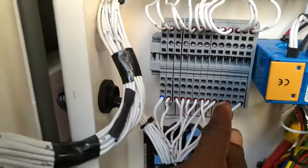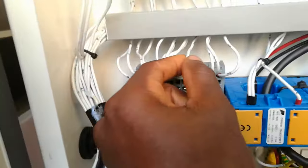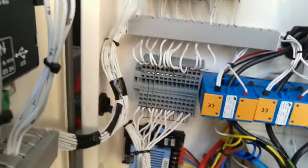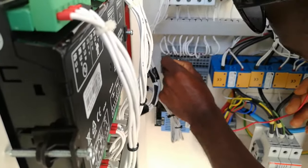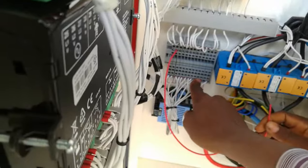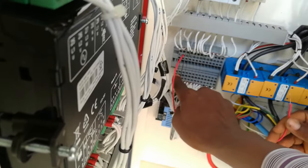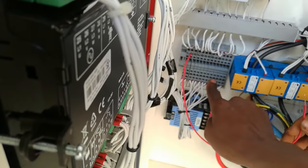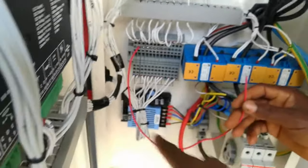This terminal is actually vacant, waiting for the ATS connection. That terminal is attached to this wire, which in turn is linked to this place. We're going to do a loop to perform a self-test on the module, because these two terminals — this one and this one — are the ones our ATS command wires will connect to.